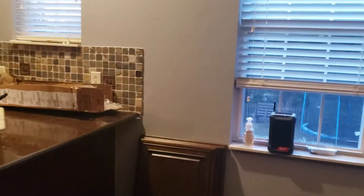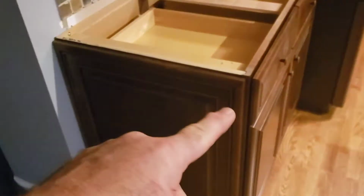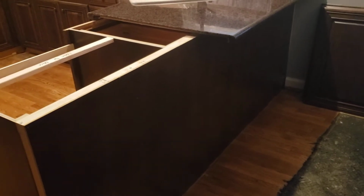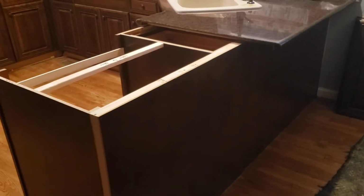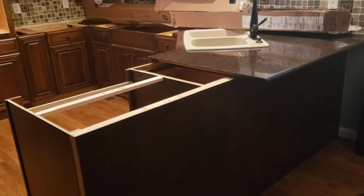Now on the faux doors that were ordered for the back of the island, these are the faux doors that are ordered to go across the back. We received two 21-inch doors and two 24-inch doors, if you see that. So when we go to lay these out on the back of the island, a 24-inch door would be here on the end of the run like that. So one of the 24-inch doors would go here, but the drawing clearly says 21, 21, 21. So I don't know what the other 24-inch door is for. The customer is going to go ahead and bring it back to the store so that you can send it back to the company. They may say field destroy it and you can give it to the customer as a sample. I don't know. But otherwise, we're going to need two more 21-inch doors.